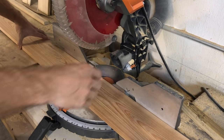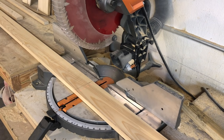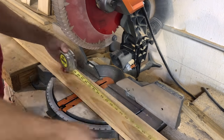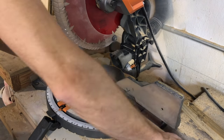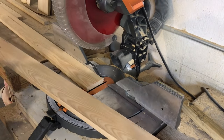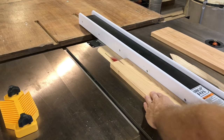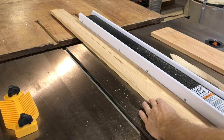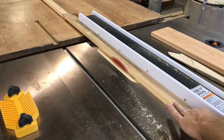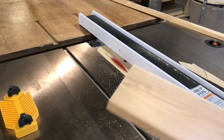To get the specific plans and how to measure, you'll need to visit the full post linked in the description. To get started, I'm cutting some 1x4 and 1x6 cypress to length. All you'll need for each storm window is one of each of these, and you'll be left with little to no waste the way I've set it up. Once you get them cut, it's time to take them over to the table saw. To rip everything to width, I've set my fence to 1 and 11/16 inches, which should rip the 1x4 almost in half depending on your blade kerf. Run the second piece through just a little bit to shave it so you've got two identical pieces — those are going to be your stiles.